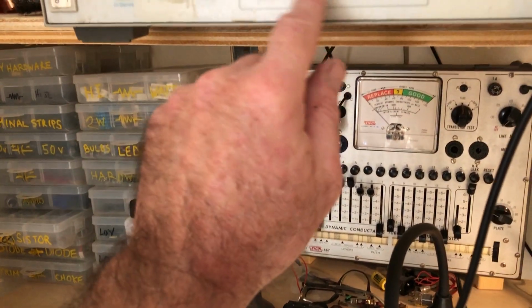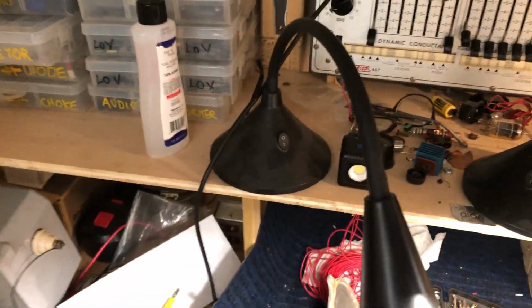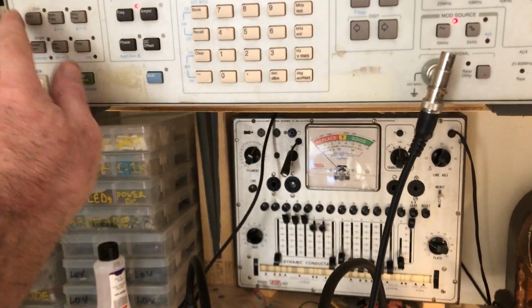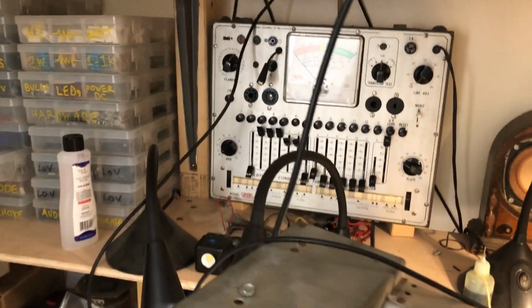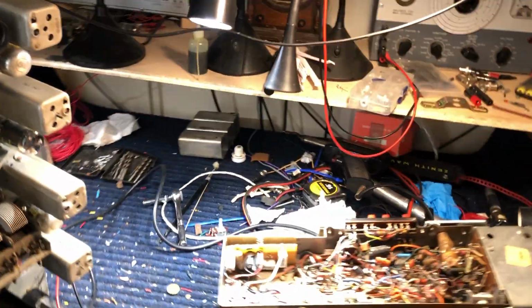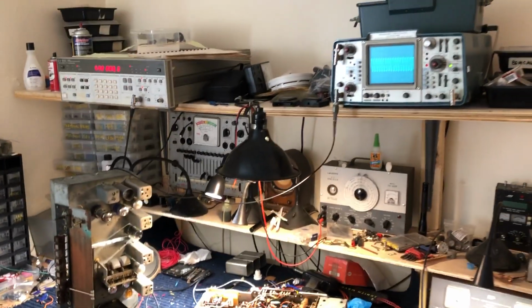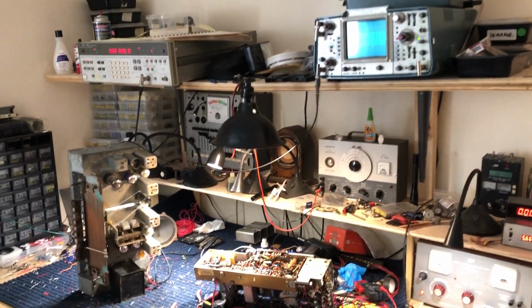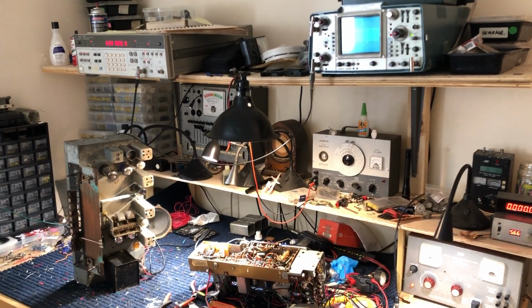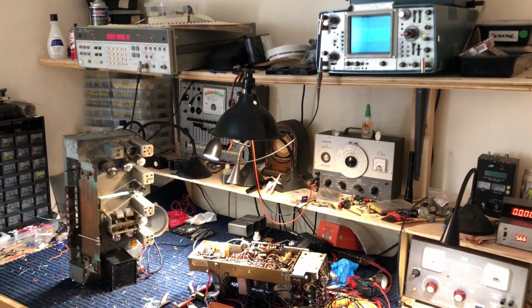Let me increase it to 1 volt. You can hear it sweeping very quickly. Even up on the shortwave, you can hear it. So basically, we don't know what's going on. The analysis is that the signal is coming in through the front end, and we can hear it, and it's tuning, it's tracking. The local oscillator is working, at least on the broadcast band.